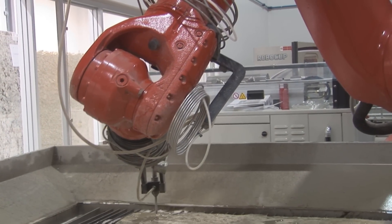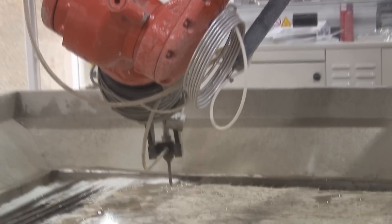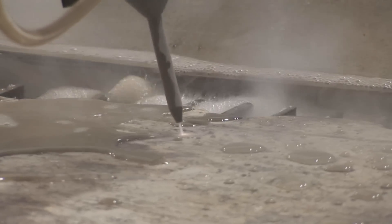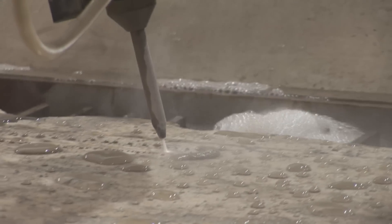The conventional water jets are cutting at 12 to 20 inches a minute and we can cut on our machine at 35 inches a minute. We can do the sink cutouts, all the rounded edges. We can angle the water jet forward, improving our time and efficiency.